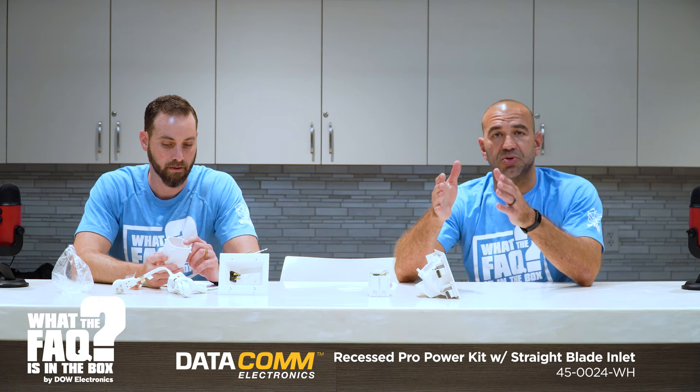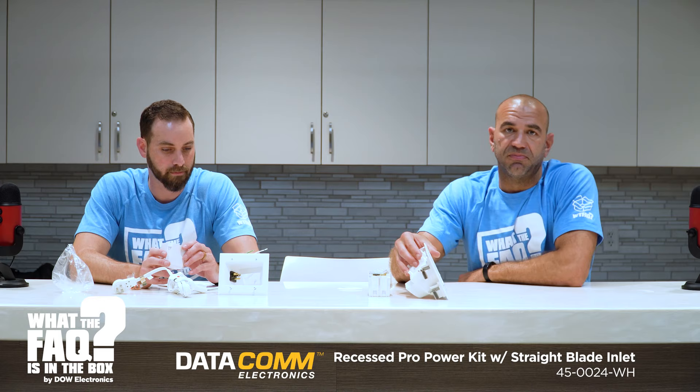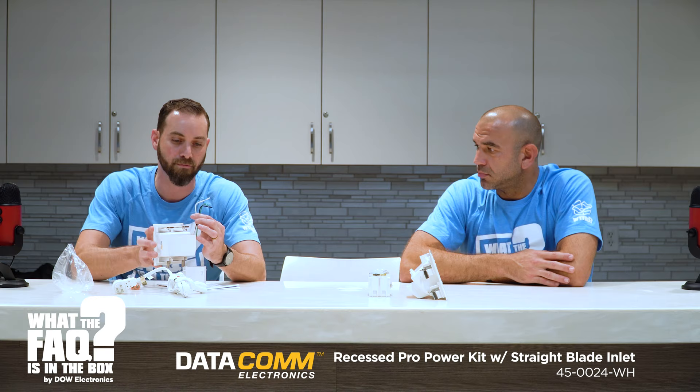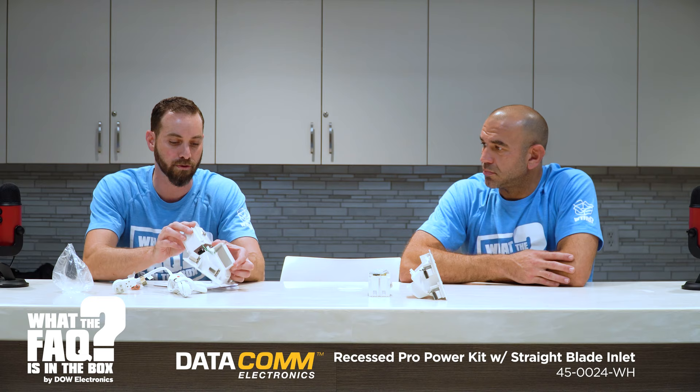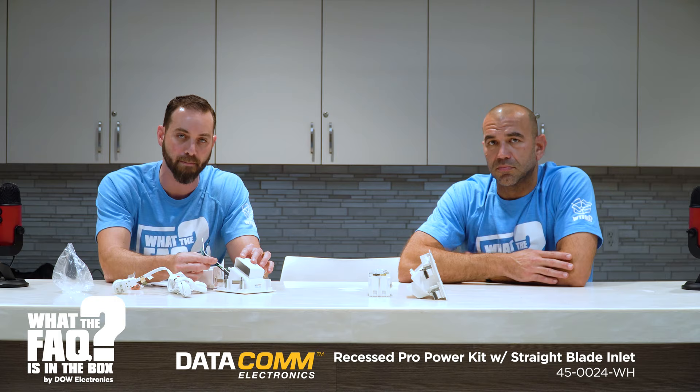A lot of these TVs now come on such a small bracket — they're meant to sit really tight against the wall. When you recess in all of your cords — the low voltage, the HDMI, and the power — you can sit that thing much more flush against the wall. A really nice installer-friendly feature: they did not tuck the connection wires behind a box before you have to connect the Romex. You do get room to pull your Romex through and connect it. They have a separate box that goes over those wires once you have everything connected and seals down, so you're not trying to do all your wires in a very small space — you're free to do all that beforehand and then connect the box.